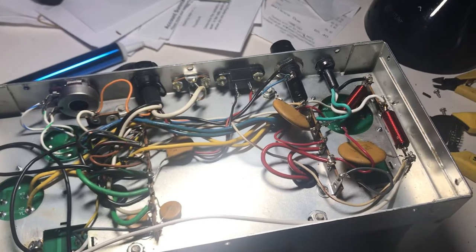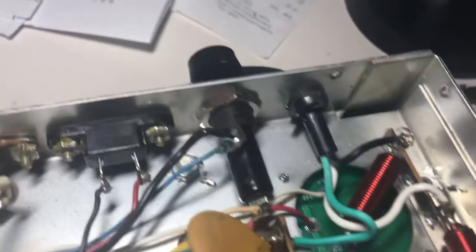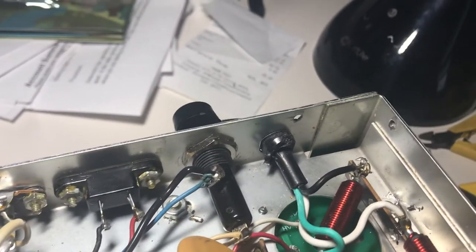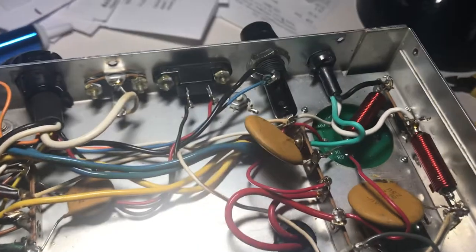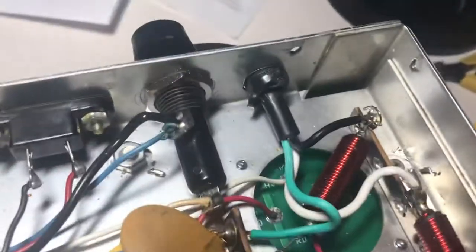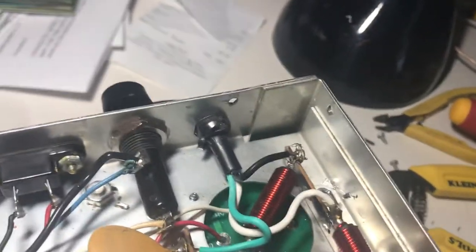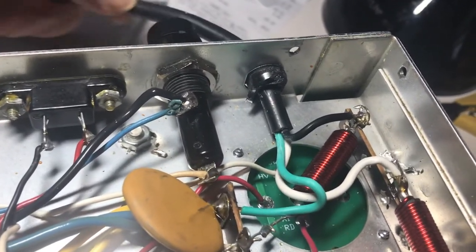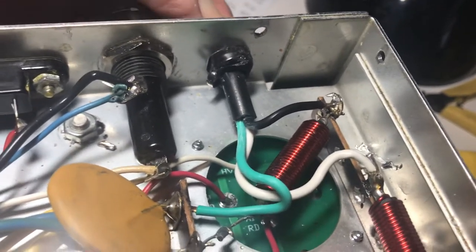This is the time to rewire this AC4 Drake power supply. I was actually able to use the same grommet that worked with the old power cord. The old power cord was a two-wire from 1968 or something — a two-wire power cord, which is not good for safe operation with a grounded power plug. I was able to squeeze out this grommet with some needle nose, just squeeze that and pull the old power wire out. And I was able to use the same grommet by smashing it down really hard with needle nose and pushing the grommet in.